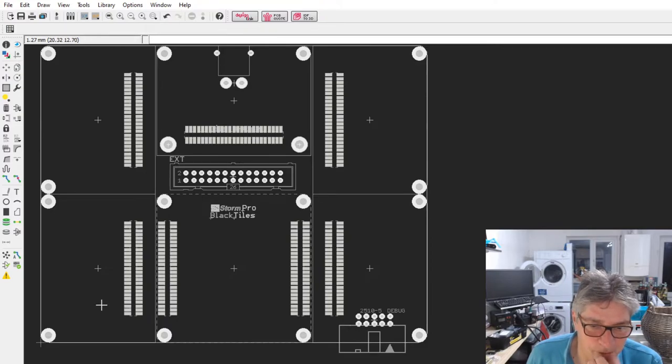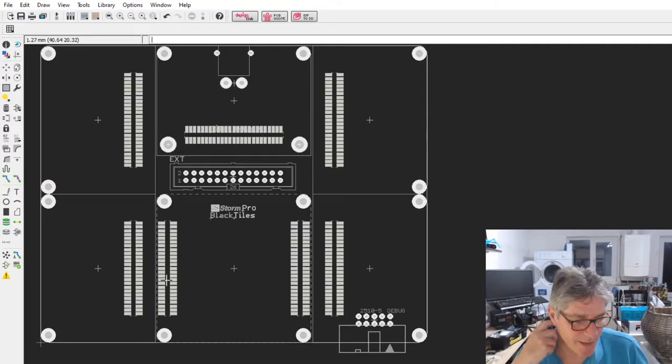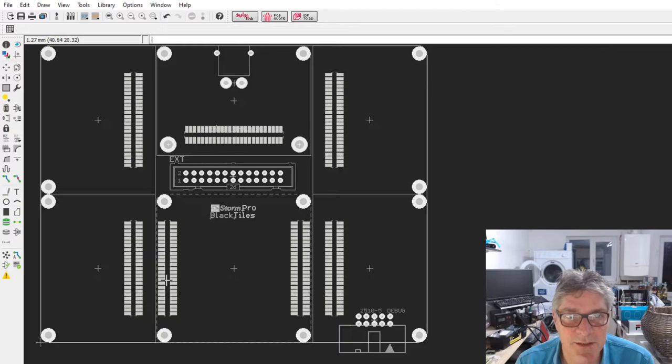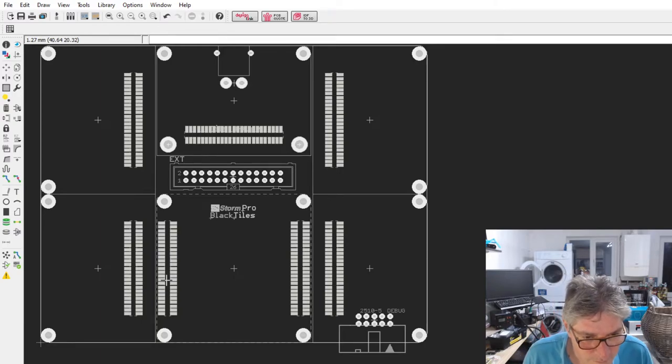It can be quite fast. You could push 100 megahertz through it, maybe a couple of hundred megahertz. It depends on how resilient the signal is and whether you're using differentials or not. But certainly 100 megahertz, maybe more. For some of the tiles that are further, signal integrity probably isn't quite as good, but if you're using differential, you could probably rock it a bit faster. You'd have better common mode rejection.